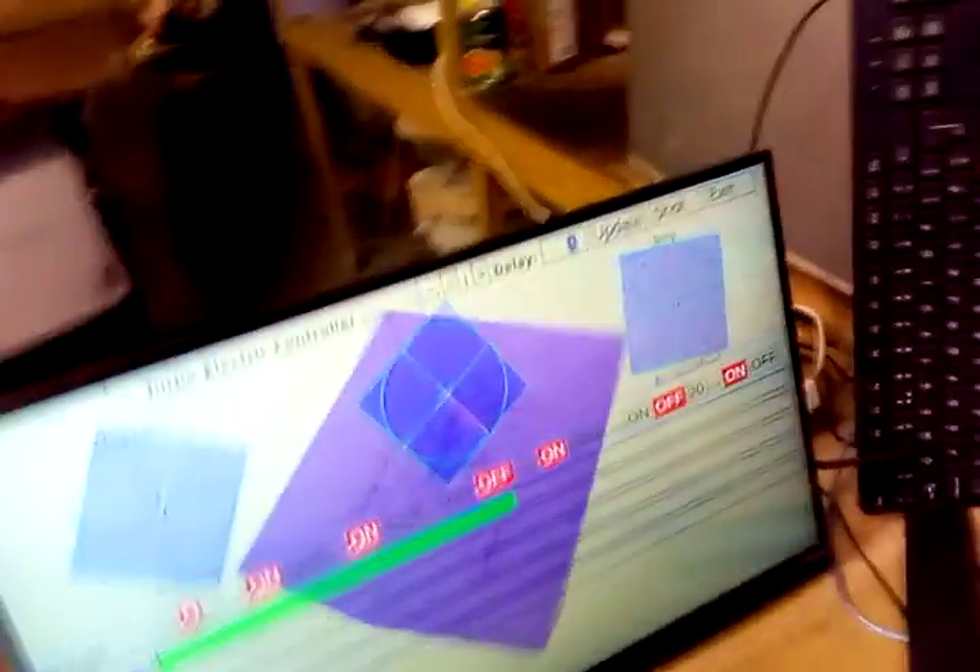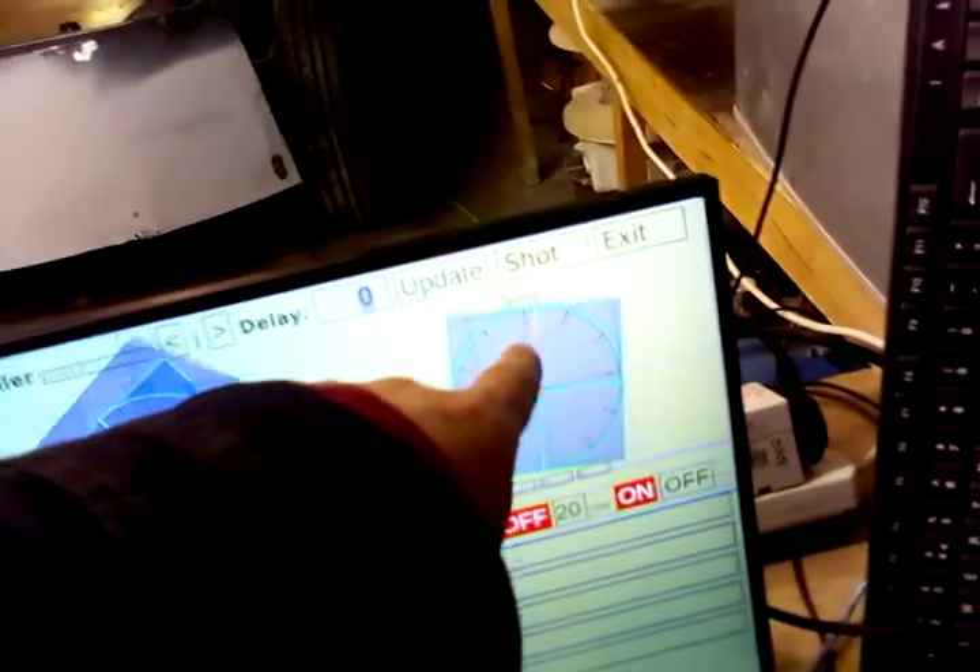I can release the brake slightly and make it go faster and it will work. What about cooling? In that brief run I think the temperature gauge went up to 60 — and this is not degrees, it's a relative scale. If it goes right around to 100 it's probably around 50 to 60 degrees. Where it's at now, about 52, is probably around the 26 degree mark. It's not proportional — by hand touch I'd say it's somewhere between 30 and 40 degrees, like a radiator that's cooling down slightly.